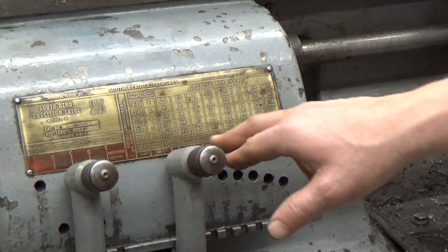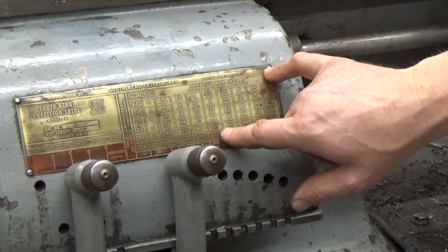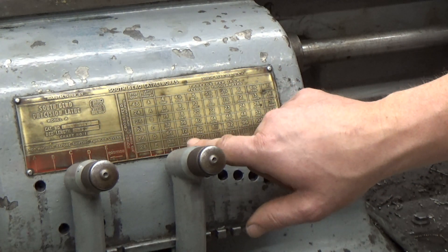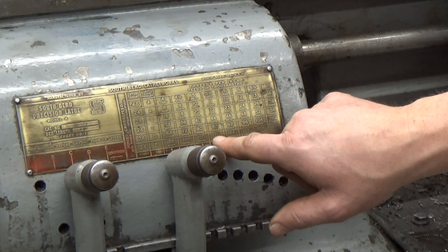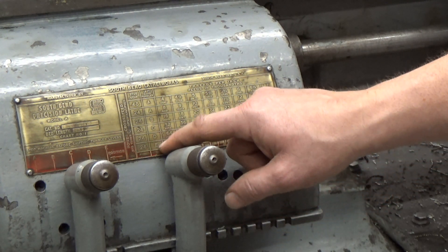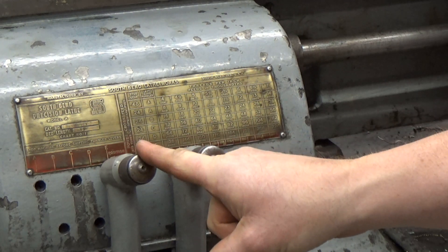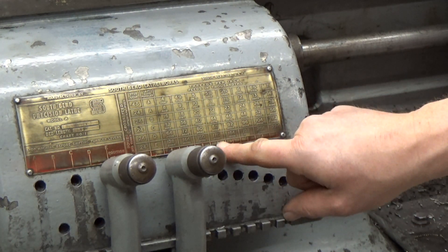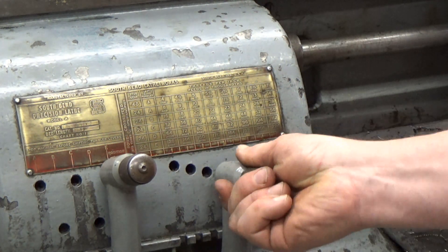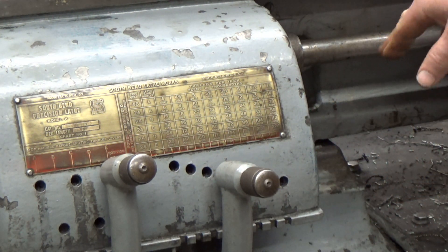So seven threads per inch is going to be about 40 thousandths per revolution. If we want to have an automatic machine with a real fine surface cut, I'm going to aim for about 10 thousandths per revolution, so looking for 0.01 inches. To achieve that I need to have this in the letter E position over here. Pull this lever out, slide it over, and engage it to the letter E. Then to get 10 thousandths per inch, put it in this column — slide this over and up — and now every single revolution of the chuck will result in 10 thousandths of travel on our lead screw.